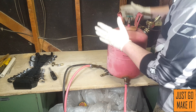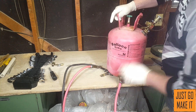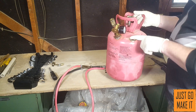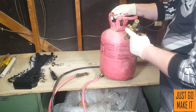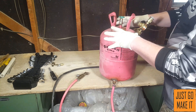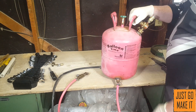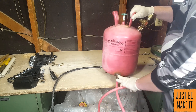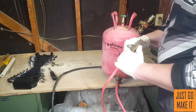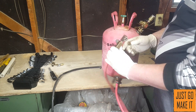I have taken a helium tank — originally for balloons — and I drilled some holes into it and soldered these brass fittings in. On this side I have an air nipple, and this is a regulator with an air chuck that also unscrews so it doubles as the fill port. Right now this has got probably a couple gallons of oil in it, and at the bottom here is my oil outlet. This valve is actually a flow control valve for hydraulics, so you can very finely tune how much flows through it.